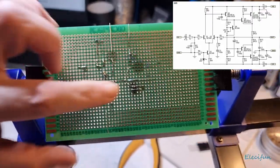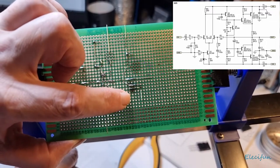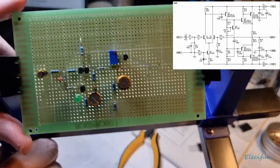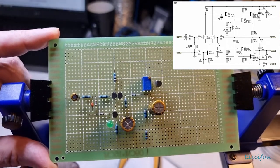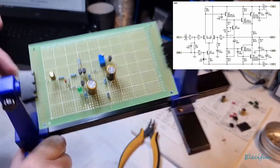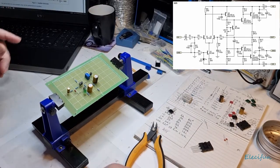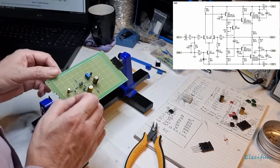So what we're looking at now is this leg just here. Yeah, we need to attach a 1K to this and then we need to put the transistor here. Just for a little look, see on that side. Yeah. All right. So let's get this doing then. 1K, so that's going to come off that leg, yes.